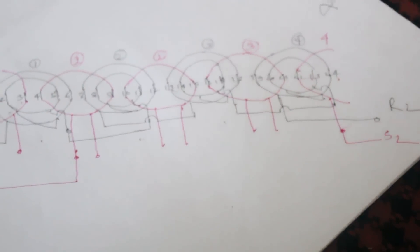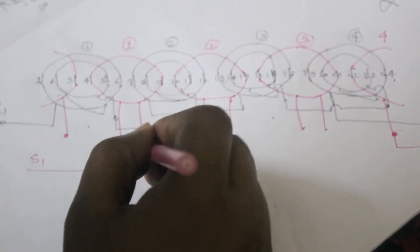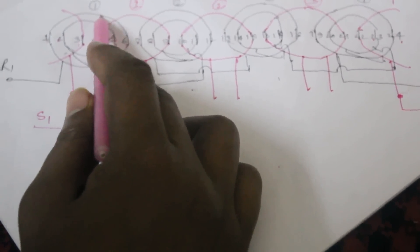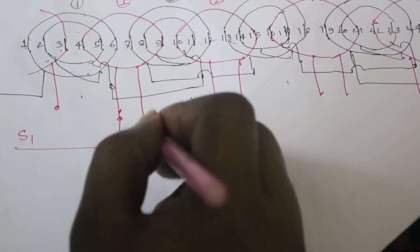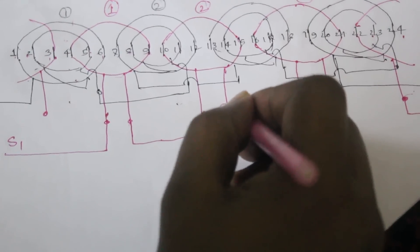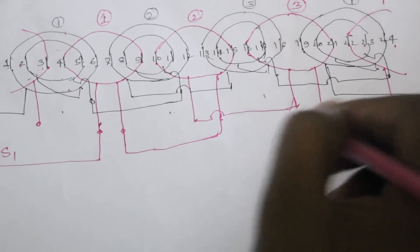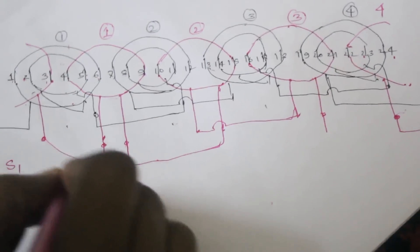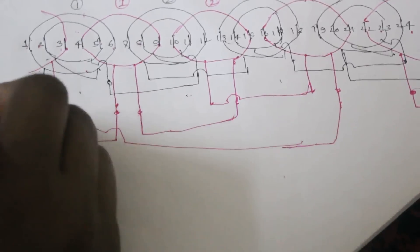This is the running coil — running and starting are each 4 poles, but the running coil uses 2 coils per pole and the starting coil uses 1 coil per pole. The finish of each coil connects to the next coil's finish terminal, and the start connects to the next coil's start terminal. The finish connects to the next coil finish, and this continues through all coils.